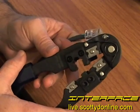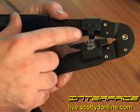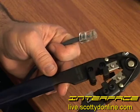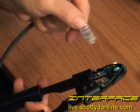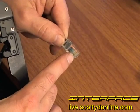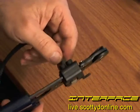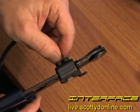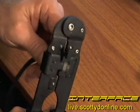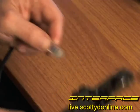This is the part I call 'commit,' because once you crimp the RJ45 onto the Ethernet cable, you've committed to the layout of those wires. If any wire is out of order or not deep enough to make a solid connection, you'll have to cut the end off and start over. The back of the crimping tool has the teeth; the front is where you insert the wire. Take your Ethernet cable with the RJ45 end — copper inserts facing up — place it in the crimping tool, hold it securely, and squeeze as hard as you can until you can't squeeze any further. You'll hear a click and that RJ45 is on to stay.